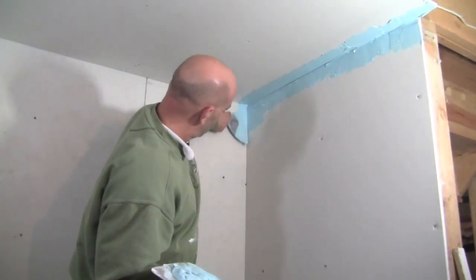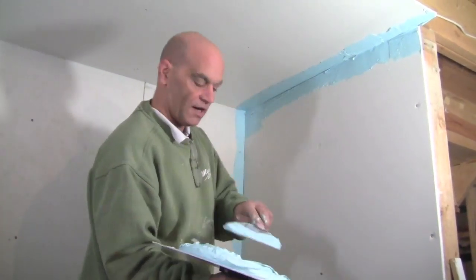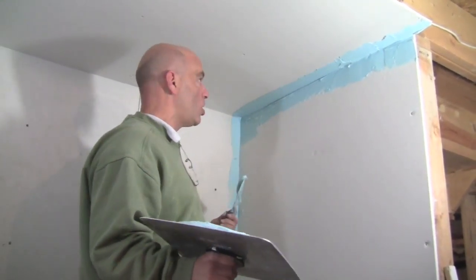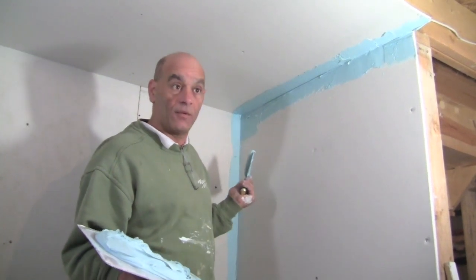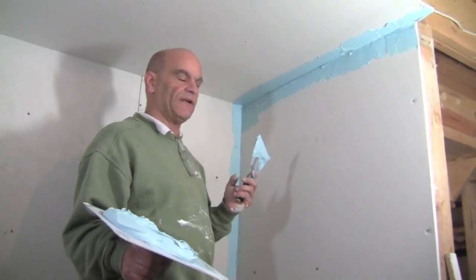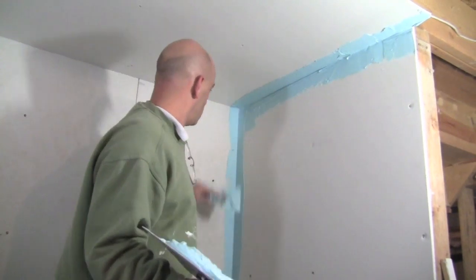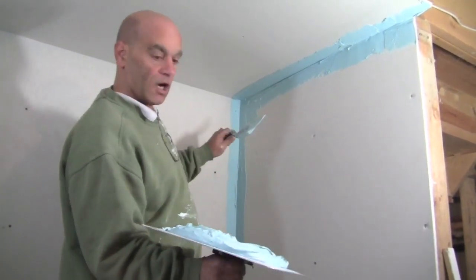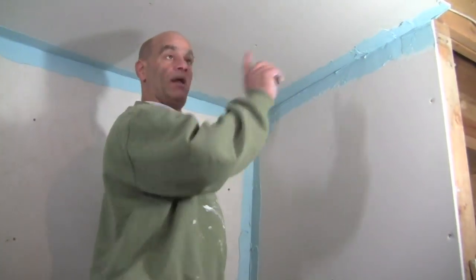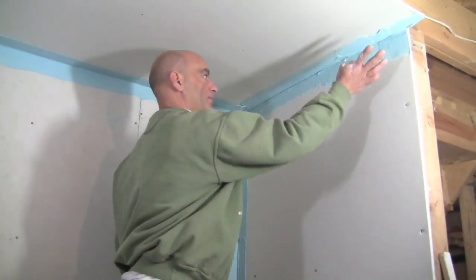Now inside — this is what we're doing for our first coat. We're going to put enough mud on so we can start putting some tape on, and you don't want to wait too long because the compound starts drying right away. You don't want to do what's called a flash dry, where you start getting a crust over it — that's no good. So just like this, I'm going to go ahead and coat the rest of this and I'll show you how we put the tape on.